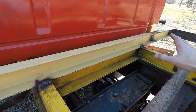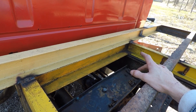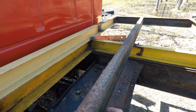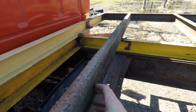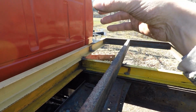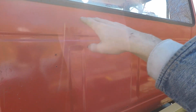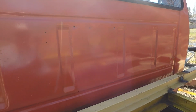And then once I get the winch mounted, I'm going to take some 2-inch ID pipe, which is about 2 3/8 OD, and I'm going to make another cage that'll come from just outside of the winch drum up, and then I'll run it back at an angle to meet this pipe in through there, and that'll tie it farther into the frame.